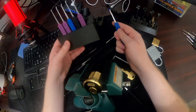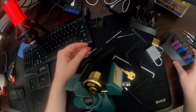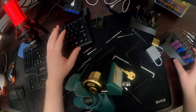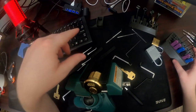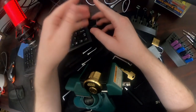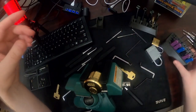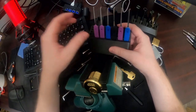So, for American-style locks, we generally have keyways that the saying is you can drive a bus through them. Like Kwikset, even Schlage. Schlage is a lot better, but compared to European locks, they're what we call paracentric, which means if you had a line drawn down the center, you'd see that a lot of them are crisscrossing into that area. So that's where these little 15 thousandths make sense, is in those super tight keyways.